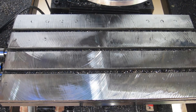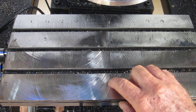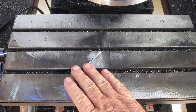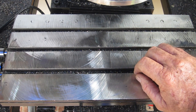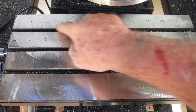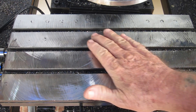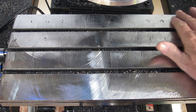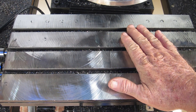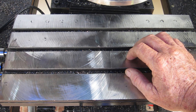It's actually performed pretty well - this is one of those Deskar branded tips. It's performed pretty well for a homemade holder, the first real thing I've made in the mill. What a difference a fresh tip makes! Something bit me though. This line here is a bit of a worry - I fed it back across here to cut, then moved it up and fed it back, and there's a definite step in there. It's telling me I've still got a tramming problem. I think I've had enough of trying to cut this for another night. I'm wishing I hadn't tried to weld up these bolt heads - might have been better off just letting them stick up.